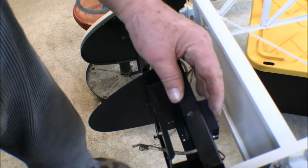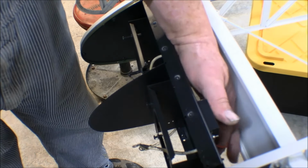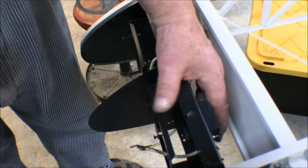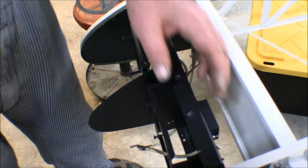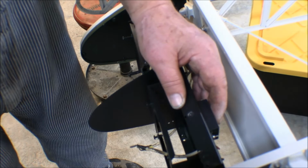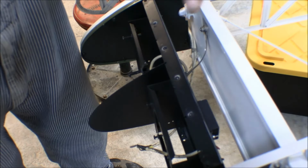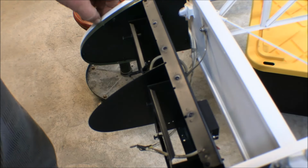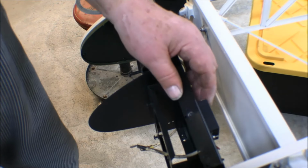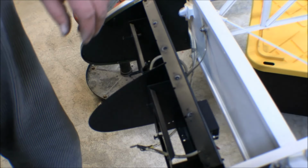So I put this adapter in there, and I still got to wire it in. It's going to be attached to the power line and to the ground line and hooked into the landing light itself. So that's got to be put in there. And what this does is, if you turn the landing light on, the landing light comes on. If you turn it on, then turn it off, and then turn it on again, then the light pulses. Well, anyway, like I said, I still got to wire that, but that's in there. And I just put that in with a couple little screws, some of the ones that I'd painted black so they don't show through the front.